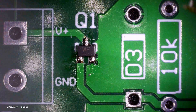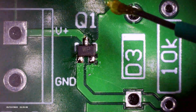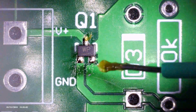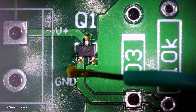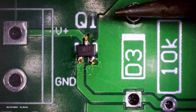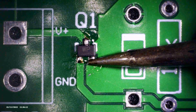What I'm using to put the flux on here is a 22 gauge wire that I usually use for breadboarding. Sometimes when I'm looking through the microscope I forget how small these parts are that I'm soldering. All I have to do after that is reheat each joint to let the flux do its job, and then I'll come back and clean it.